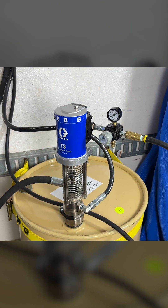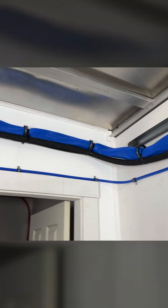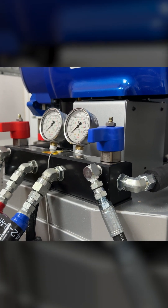And finally, the 3/8-inch recirculation line. This line feeds directly to the manifold and keeps the chemicals in motion, maintaining their mix and temperature. This is particularly useful for half-pound applications. The recirc line can also be used to help equalize pump pressure.